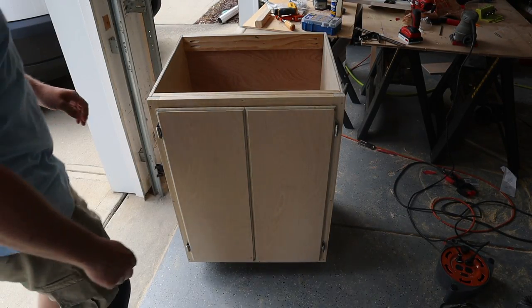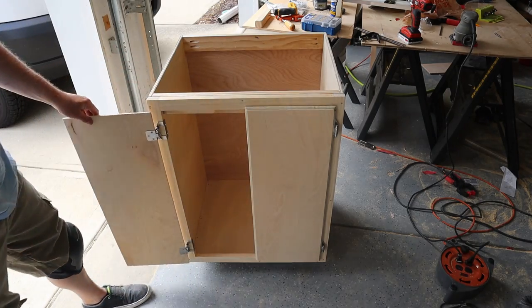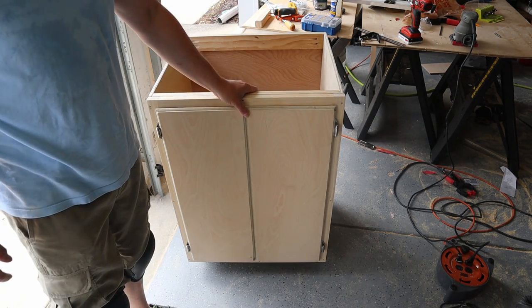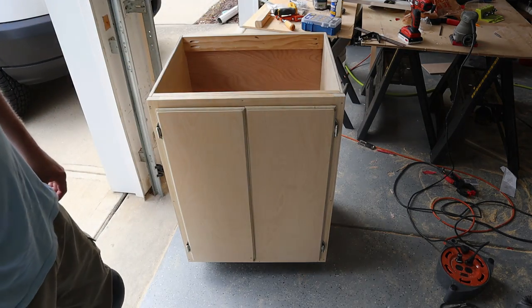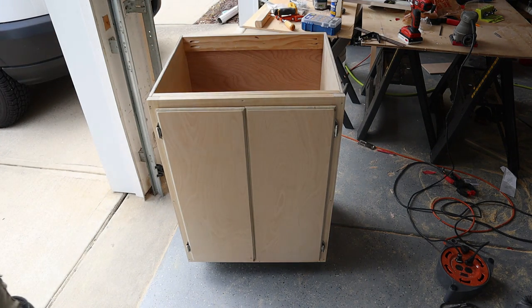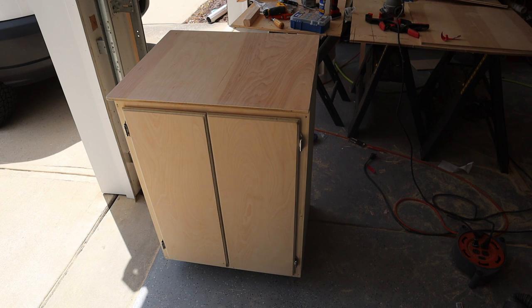That, my friends, is a vanity cabinet. I thought the self-closing hinges would be good enough even with felt under there, but I don't think they'll keep it from rattling, so I'm probably going to put some extra latches behind. I just cut a top — I left some overhang on the front so water on the countertop will fall off the lid instead of dripping onto the cabinet, and a little overhang on the side facing the entryway. No overhang on the back or the other side. I ran out of sandpaper, so there we go.